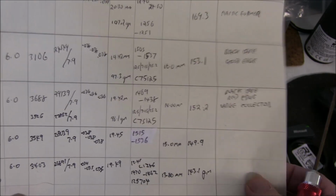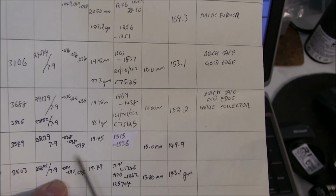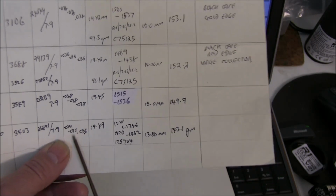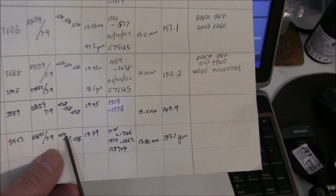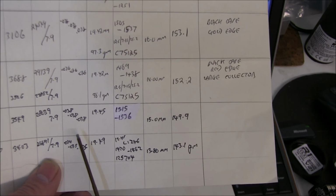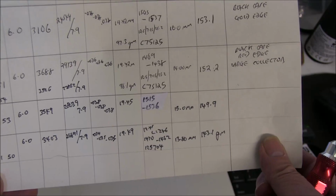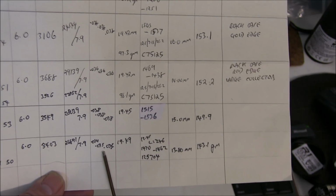The winding resistance, the fabulous winding resistance on the R1. First of all, the Surpass had it 0.036 for a very short time. Now the R1 has got it 0.035, and perhaps even as low as 0.0345. It's just flickering a bit on one of them. So winding resistance, they've managed to edge it a little bit more. That's impressive. I'm sure it can't go any lower. This is about as low as anyone can get from now on.